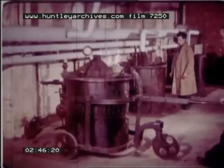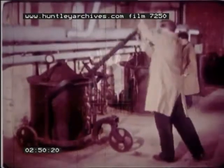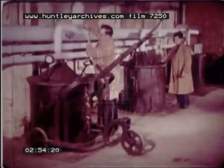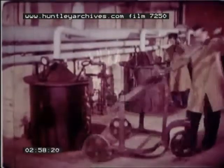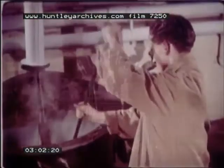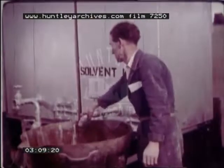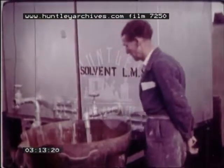The cooking parties move to the fire. As these two ingredients will not mix when cold, the temperature is raised to between 500 degrees and 600 degrees Fahrenheit for a definite period. At this temperature, the two components unite to form a crystal clear medium. It's allowed to cool, and at a specific lower temperature of 180 degrees, the solvent and dryers are added.